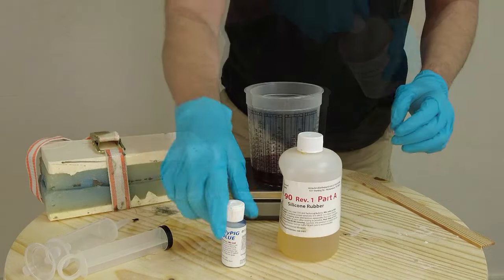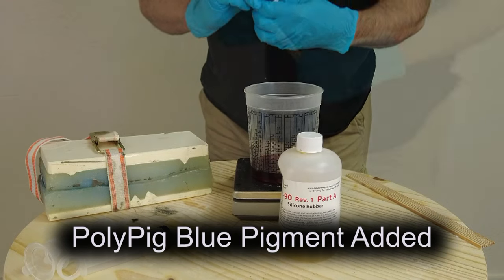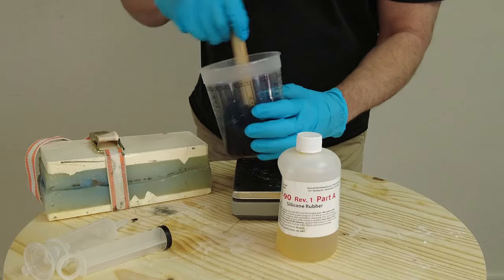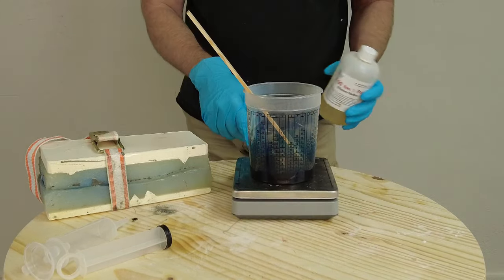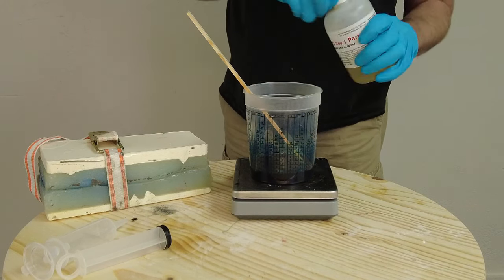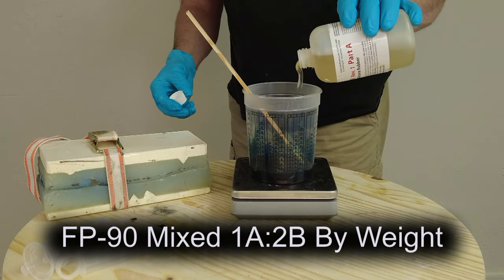It takes a very small amount of casting rubber to make this prop wrench, so we're mixing up a 150 gram batch and adding some PolyPig blue pigment to give a background color behind the metallic powder. I've measured out 100 grams of part B and I'm stirring the pigment into the B before adding part A — that way we get the color just right without using up valuable working time. We could also add PolyPig black or white to get a gray background, but a little blue works perfectly here.